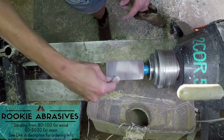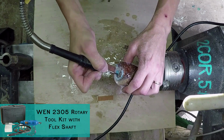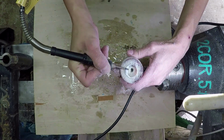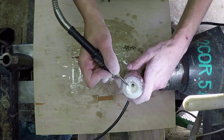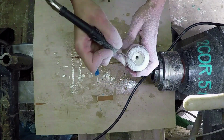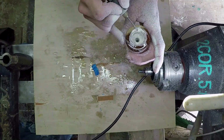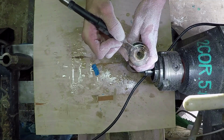So after I pulled these off, both of them had some buildup from resin and everything else around the taper that I used to mount them. I needed to fill this hole back up anyway, because later on down the road he's going to need to drill and tap it, or however he's planning on mounting these gear shift knobs into the vehicle. He's going to need to redo that hole anyway. So I decided that I'll just take the Dremel and sand that all down, and then fill the holes in both of them with fast set resin similar to the colors we used.